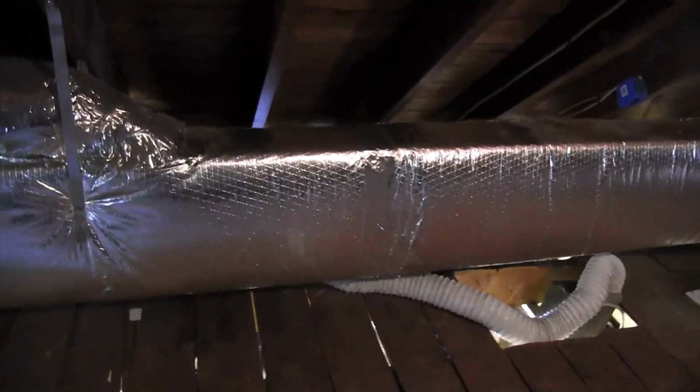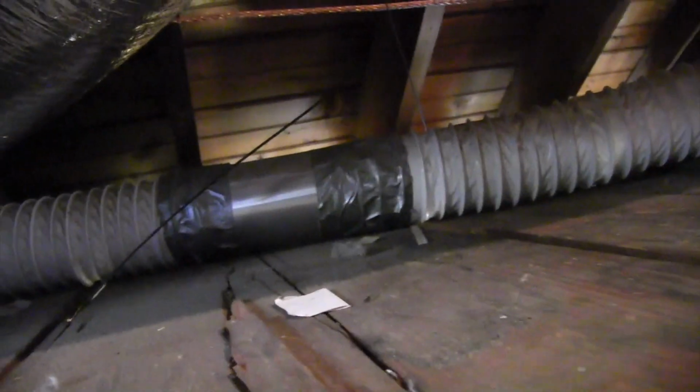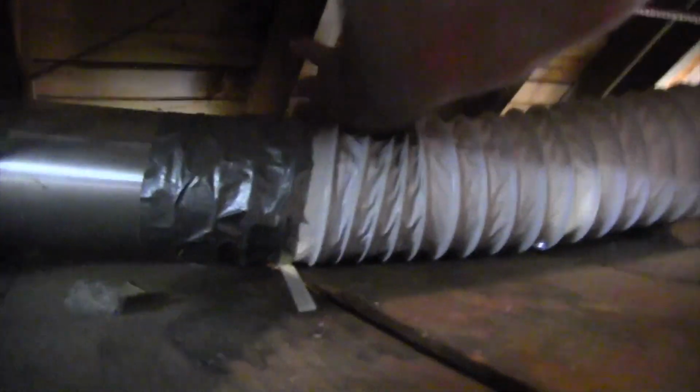Once the rod is inserted, I then unchuck the drill. I leave the rod sticking out on the other side, and then I go back and find it and finish my layout and go back and install or drill my hole. The tip saves a ton of time. I've been using it now for probably 15, 18 years, and it's probably one of the best tips I've ever learned from another contractor.